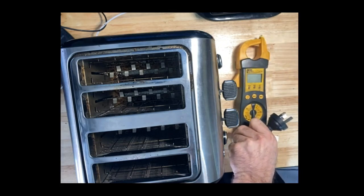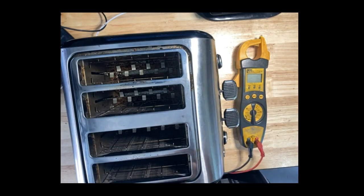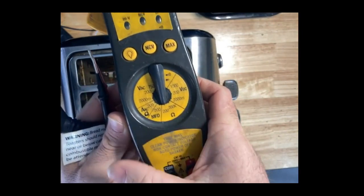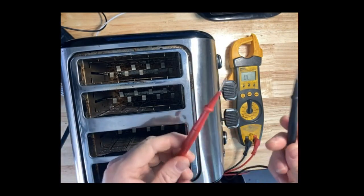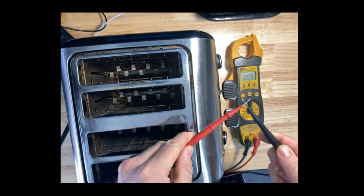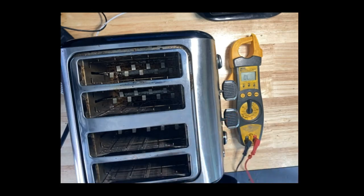For this test I'm going to use my trusty multimeter. If you're not sure how to use it, I've covered the functions of a multimeter in earlier videos. I'm going to turn it to the ohm scale — I'm choosing 200 ohms because that's the lowest scale. Before I start I give it a quick test, just to prove the meter is working, by touching the leads together. We can see the resistance measured there is 0.3 ohms. That's telling me I have good continuity through my leads at 0.3 ohms.